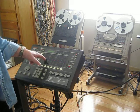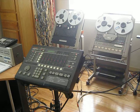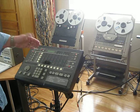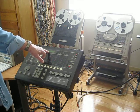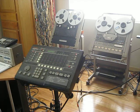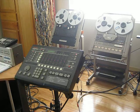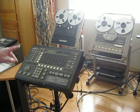Through the locate mode, I can store a cue, recall a cue, auto play, auto record, and I can set in pre and post roll locations. If I'm going to fly in a track or overdub or do whatever I want to do, I can put the particular track or tracks into record mode. Then using these auto locate commands, I can cause them to record at a particular location on the tape — physical location in hours, minutes, and seconds and frames. Or I can actually have it locate based on a MIDI beat location. There are a lot of different precision locate modes that I can use for recording when the drives are synchronized.